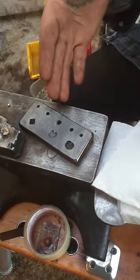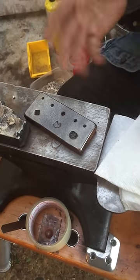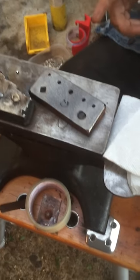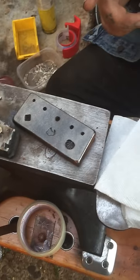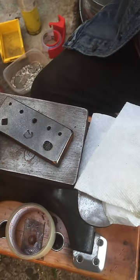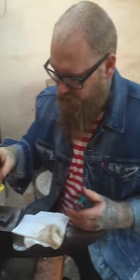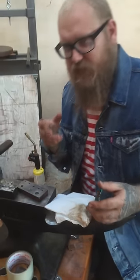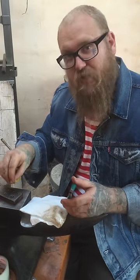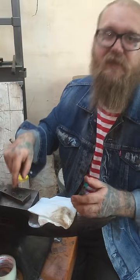Now, here I have shot plate four. This is the one I have in front of me. A lot of you guys have bought this one. One of the things I've noticed is a few have asked about the big one in the center. It's kind of deep, like a cone. Kind of goes in like a cone. So if you take a perfectly round shape and start hammering it in, it's going to kind of mushroom over the sides. You can't get that silver all the way down into the tippies of the inside, okay?